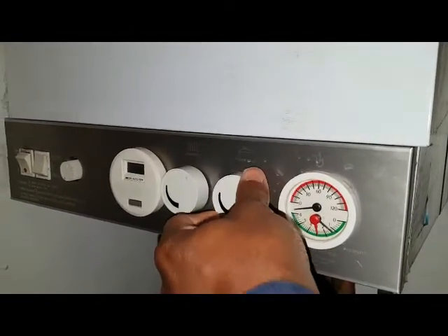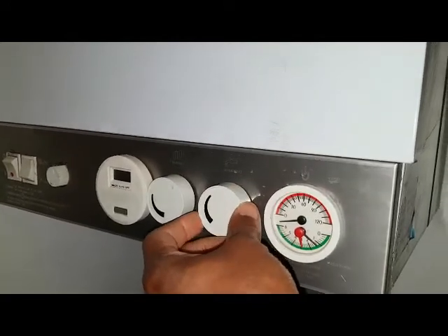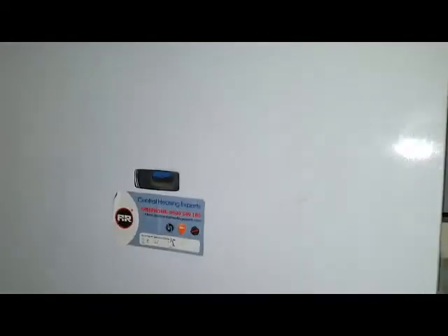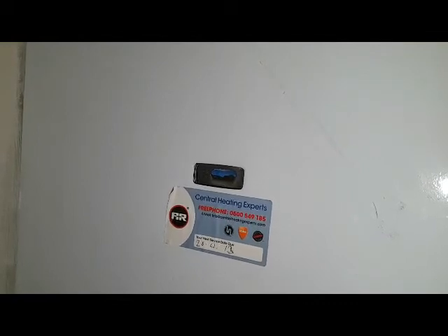There's no clicking action — oh, there's a clicking action now. So the thermostat's working — that click represents it is working. You can check the flame picture as well. See it increase — and it's decreased. So that's me turning the hot water thermostat up and down.